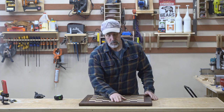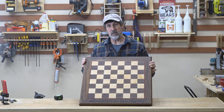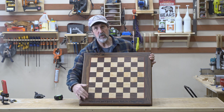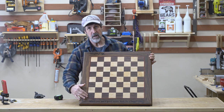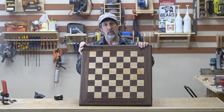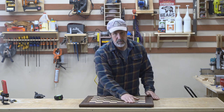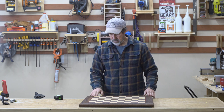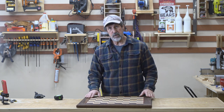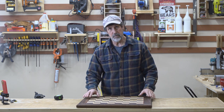One of the biggest mistakes I made was engraving this with the intent of putting a maple inlay in here. I should not have tried to tackle that with the time limit I had to make this board for Christmas. I tried to fill it with black CA glue and that was a mistake - it's worked well for gap-filling, but for filling engraving, don't ever try to use it. I had too many air bubbles and it just looked terrible. What I should have done was practice my inlays more or fill the engraving with epoxy. I don't think the padauk stood out as much as I liked either - with the tung oil it darkened everything up and you could barely see the padauk on the splines and border. On previous boards I used Armor Seal and I liked how the padauk stood out with that versus the tung oil, which darkened everything up a little too much for my taste.